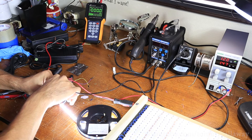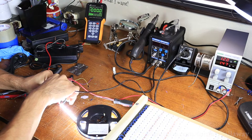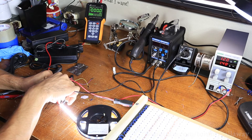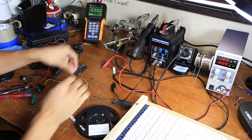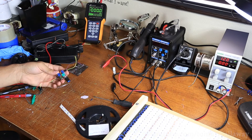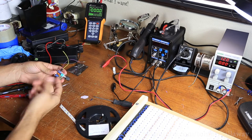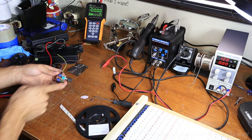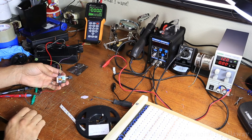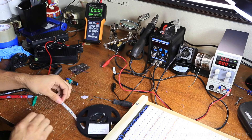Just eyeballing it they look 30% brighter, so we're just gonna not use the voltage regulator at all and instead use a couple of switches — 50% brightness or 100% brightness across two panels. I don't recommend you buy these devices. You can get a three-pack for $22 and they are neat, and you can use them in other projects, but for this project it's gonna steal voltage from you and you're gonna have less bright lights.